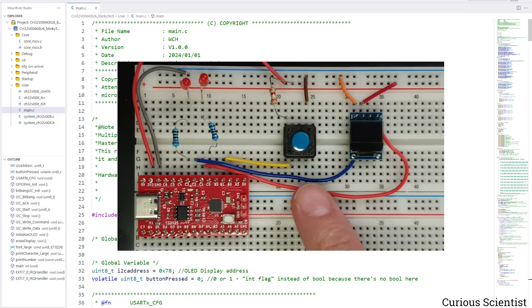And then you can see a push button here as well. It is set up with a pull-up resistor on its GPIO pin, so by default it is at a high level. But when I press the button, it shorts the GPIO pin to ground so its state will be low. This high-to-low edge is captured by an interrupt and then it will do something. So here I can test the interrupt function — what it will do is print a message on the serial terminal. I'm also testing both the onboard USB-to-serial chip and the USART functionality of the chip itself.